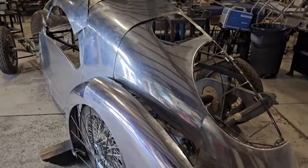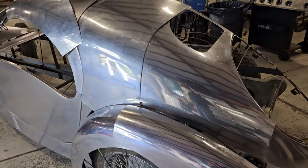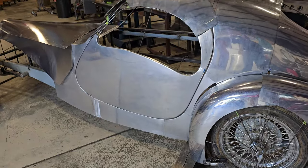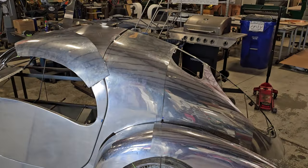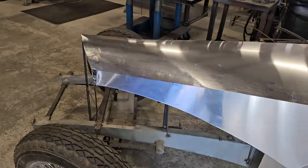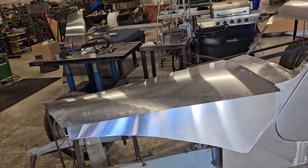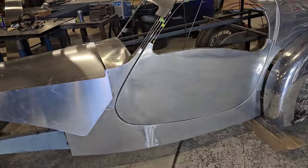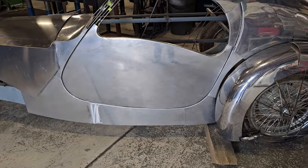You can see how nice all these little details are. All the panels need to be trimmed and then welded. We've got one weld on the rocker sill there — that was just to show him how he's going to have to do the welding. All these other panels have got a little tuning to them. The hood last night, I helped him put this roll in it. The hood's pretty simple, actually — there's got to be a bend, but we weren't ready to do the bend. Scott put the flanges on the door skin, which he made a couple days ago.